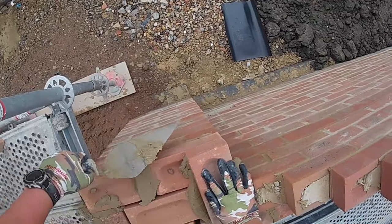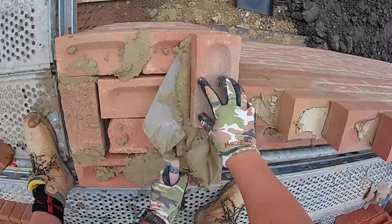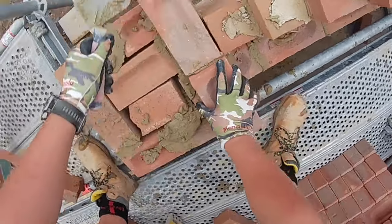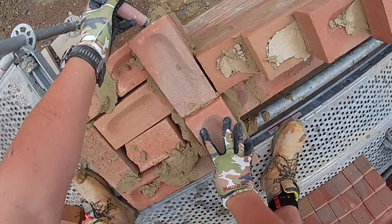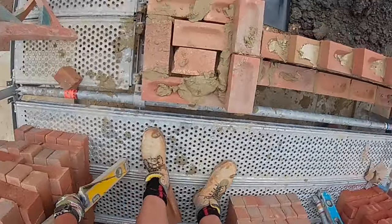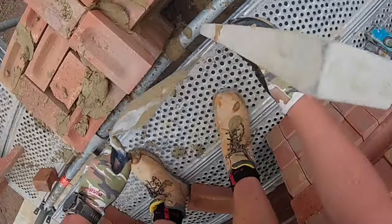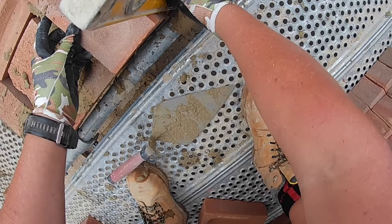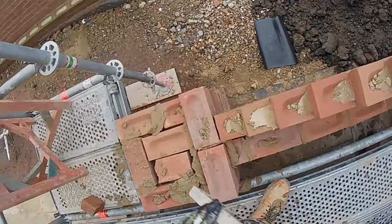bring your gobbo. In this case I smashed all the loading up on the Friday, so we didn't have much to load out. We had a few slates, a few tiles, a few hundred bricks, fuck all really. So a lot of the time it was me stacking my bricks up to waist height, reloading gobbo, bringing buckets up the scaffold, then he was walking them round to me, passing them to me, because we're on a one board scaffold here, just speeding the process up a little bit. Obviously couldn't get him laying on pillars, it's all pretty technical level work, nothing really to do there.